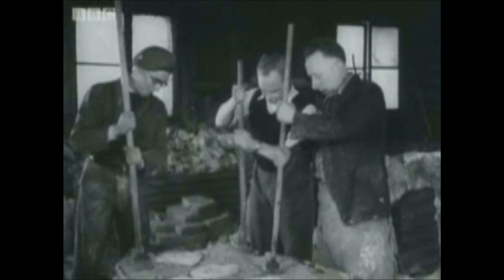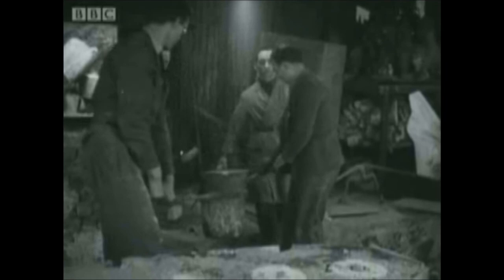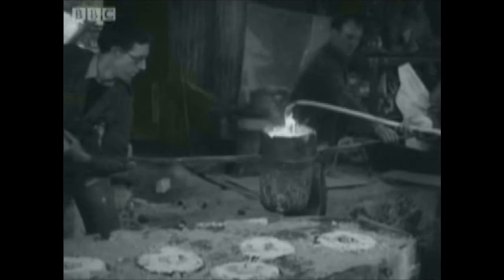The molten bronze is lifted white hot from the furnace. It must be poured quickly before it loses its temperature, and this calls for a precision of eye and deftness of handling that only come with long experience. It is part of a sculptor's trade to be able to conceive his work in forms that can be divided into sections for casting.